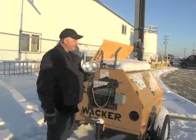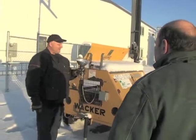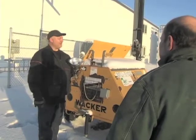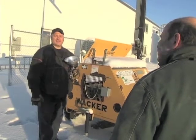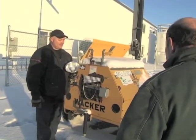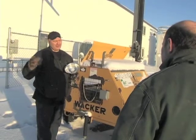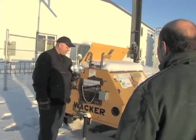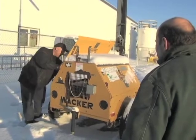We've actually had this exposed to Fairbanks winters for two years now. Last year, the lowest it ever dropped was 11.9 volts. We get just enough wind sporadically where that 3K charges the battery bank really fast. Even in the middle of winter, we've had it up to 12 to 13 volts — about 12.5 to 12.7 volts. This year we haven't had a lot of wind, so it's a little drained right now.